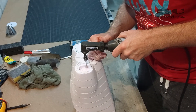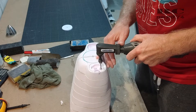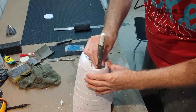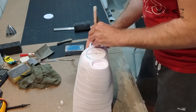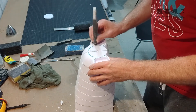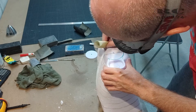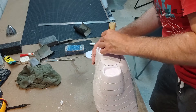The last steps on the template were to mill out the air intakes using my Dremel tool, then sand the inner sides down to the right wall thickness with 120-grit sandpaper, and finally shape the front end of the air intakes smooth and round using 240-grit sandpaper for a clean finished look.